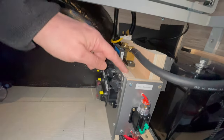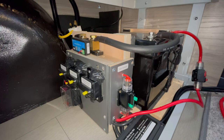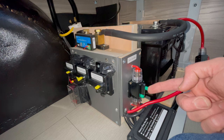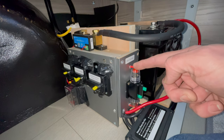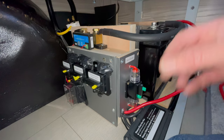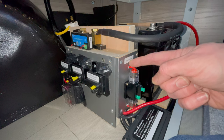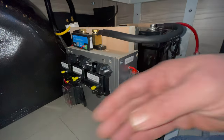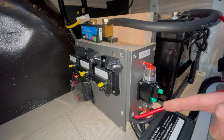Let's take a look at the distribution point. Running through what we've got: there's a 15 amp breaker which feeds up to the solar controller. I've boxed it in here with enough room for the cables relatively tightly so we don't lose too much space — we've only lost a couple of inches from the original but nothing major. I think I'll put a little storage box in here. So this feeds in from the solar controller with a 15 amp breaker.